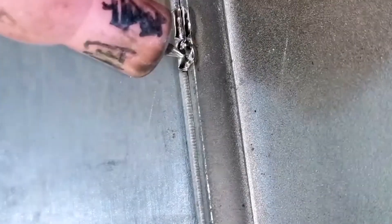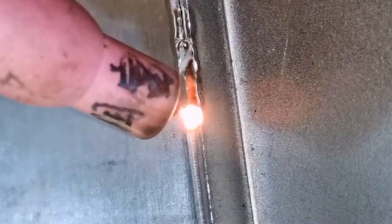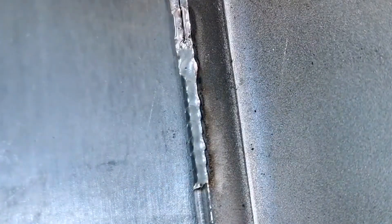If you want to use a cold welding machine for welding, the welding seam should be as flat as possible. The gap should not be too large, and there should not be too many burrs, as these will also affect the welding effect.